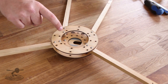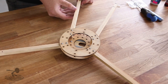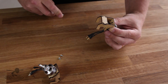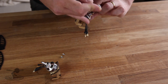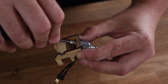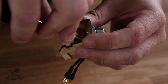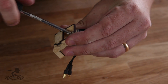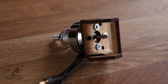The any copter can also be transformed into a V-tail by just using these holes instead and kicking the arms out and shortening the front arms a bit. When you mount your motor, think about the direction of the wires — you want them coming out on the bottom, not the top. Use the supplied screws and just screw it in place. I only use three of the four screws because the last screw is blocked by the boom, making it easier to remove the motor later.